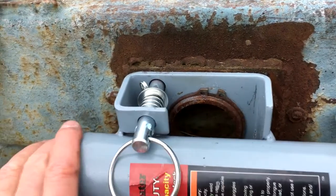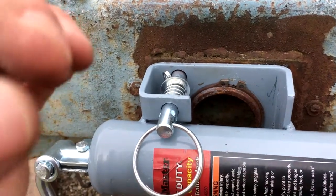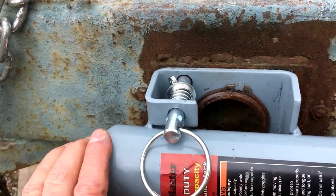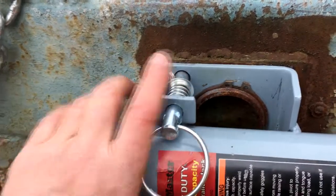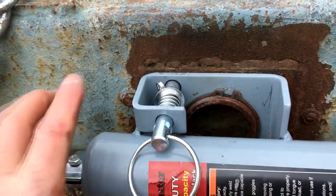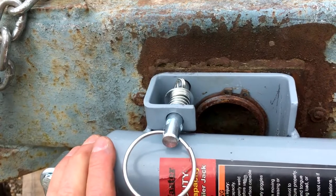If you had a Bulldog on, save the Bulldog clip. It is thinner, thickness-wise, than the Harbor Freight clip. The Harbor Freight clip will not fit in the groove that you already have welded on. So save the clip — kind of a pain. Also, when you're trying to hold this assembly up against the frame to put the clip on, it's a real pain. But if you remove the retainer clip for the spring, get that out of the way, then this just presses up.